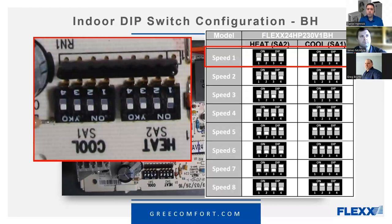What designates whether the system runs in heat mode or cooling mode is the reversing valve. Industry standard: O has always been designated as energizing in cooling mode, B has always been designated as heating mode. Many modern thermostats combine these as an O/B terminal. In that case, go into the installer setup of that thermostat and make sure on the Flex we are energizing in heat mode.